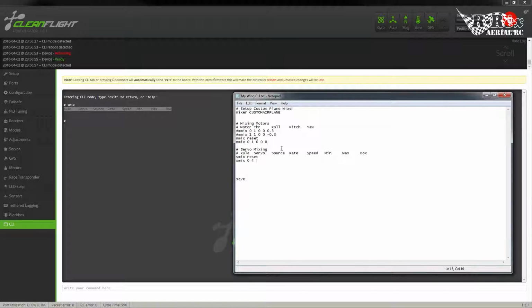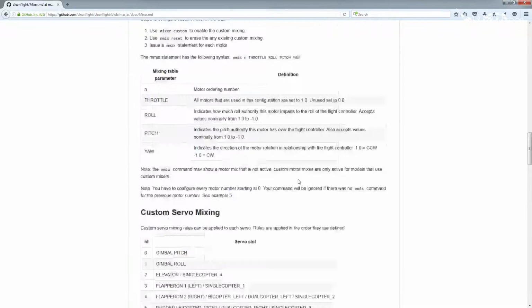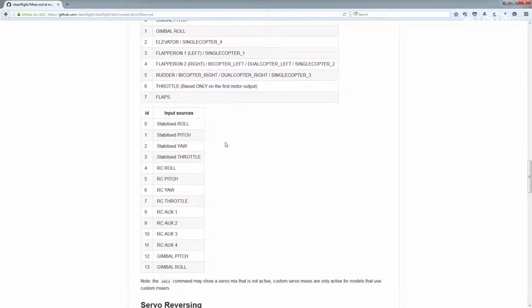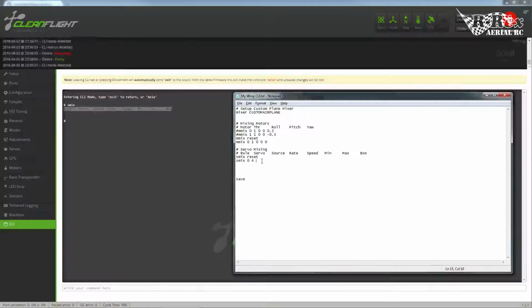Source, now this is different. Before, with the motors, you would select your input. Now you're actually going to have to go to a website and get an input ID. I will put the address to this website in the description. But what you're going to want to do is go here, scroll down until you get to custom servo mixing, and you're going to want your input sources. Now I set predefined mix up with auxiliary 3. So here's auxiliary 3, and the source ID is 10. So I'm going to copy that, head back on over to the CLI first and then back to the script. Okay, so input source is going to be 10. I probably could have remembered that and written it down, but it's there anyway.